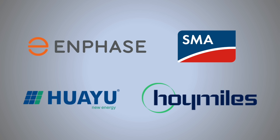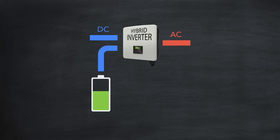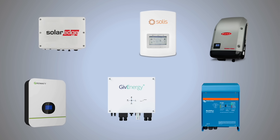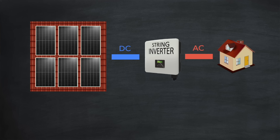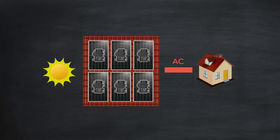And if you wanted microinverters instead, again you could use any manufacturer, although there were fewer manufacturers to choose from who made microinverters. But if you wanted to get a home battery, things got trickier. One option was to add a hybrid inverter — a string inverter that could also talk to a battery to manage its charging and discharging. This setup, called a DC coupled system, linked your solar panels directly to the battery and inverter. You could pick any hybrid inverter manufacturer, but your battery choices were limited to the brands that your hybrid inverter supported, such as Pylon Tech, BYD, or Huawei, and some hybrid inverters only supported their own brand of battery. Now alternatively, you could go with an AC coupled system instead.